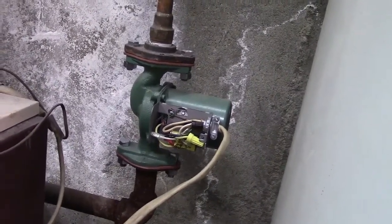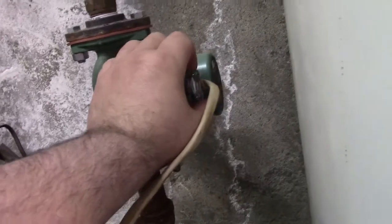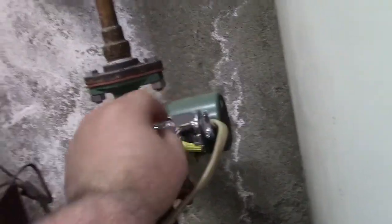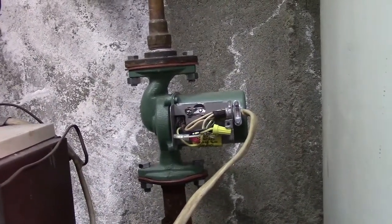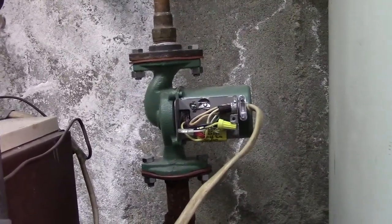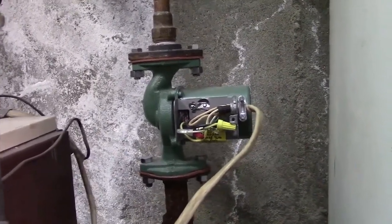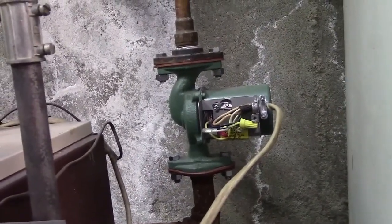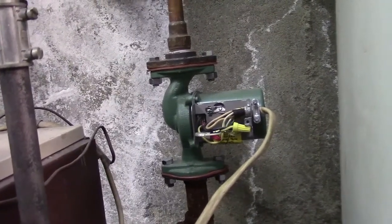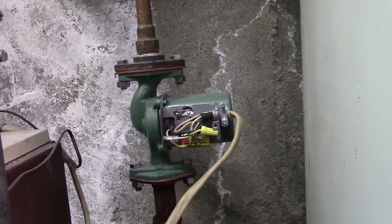After taking a look in here, what I'm going to end up doing is just sticking the bulb out the back. I've loosened the clamp and I can slip the wires through. If I were to mount it in the cover, that wouldn't be too good because then the cover would have to dangle and you'd have to take the wire nuts off to get it out. I could theoretically drill through this, but being that this pump sits sideways, that's not going to help anyone — it'll be hard to see.